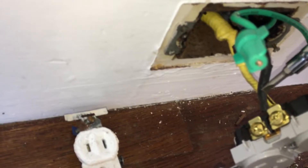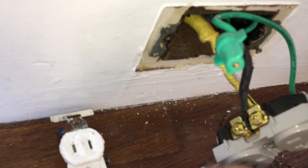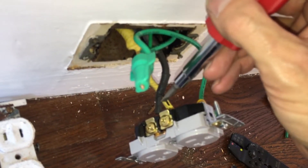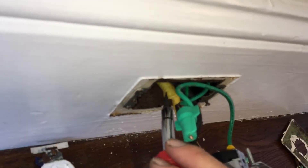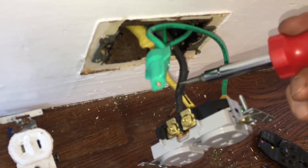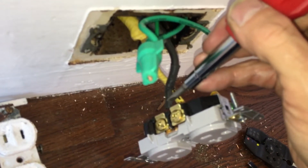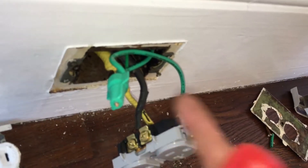I didn't want to disturb it too much, so I didn't cut, bend, or unloop the wires - I actually left them as-is and took them apart without spreading or straightening them, because old copper becomes brittle. I slipped over high-temperature shrink wrap going over the material back here and on here, so everything is protected and insulated with further insulation for high voltage and heat. This bare wire I covered with shrink wrap up to there - it'll be looped with friction tape going around protecting the whole thing.